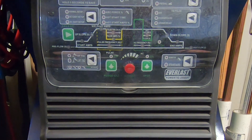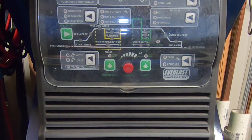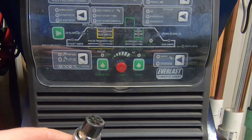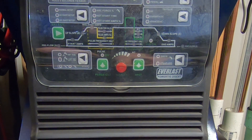The next thing to connect is our gas outlet connection. On this particular CK torch it's a little black quick-connect hose that literally plugs in and snaps in place. Now for our control port, we pull the little cap off — this applies to machines with some sort of amperage control, whether a torch switch or foot pedal. This connector is grooved so it only fits in one way; once we get it in, we screw it down until nice and tight.